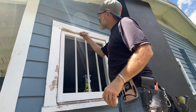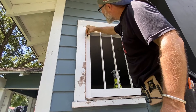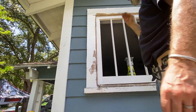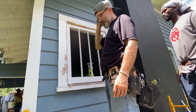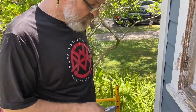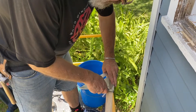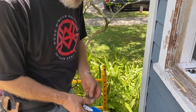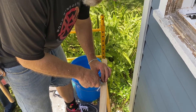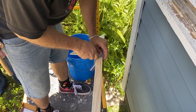Now I'm just going to go up here and see where my hinge marks are. Mark that and mark that. It's really important you get a very sharp new blade, because what you're going to do is come and cut that hinge line right there. I just put my knife there, line it up — boom, just like that. Then use my square, put my next knife cut.